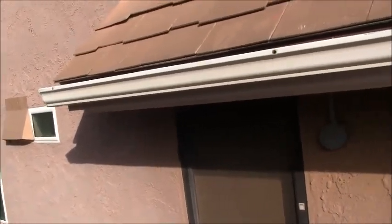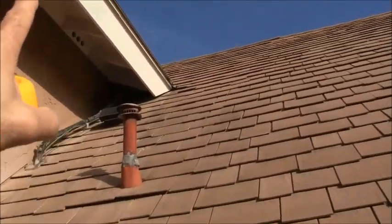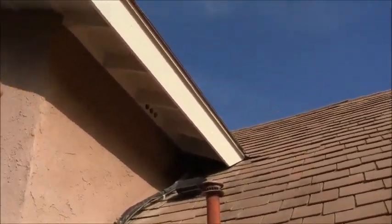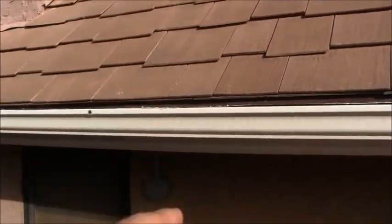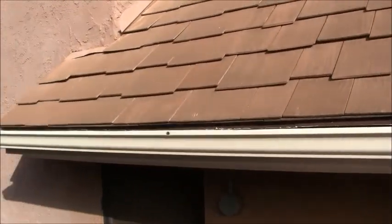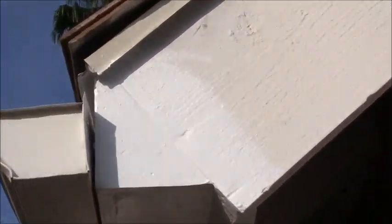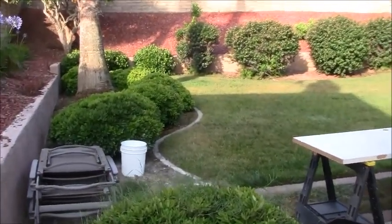On my particular roof there's an upper section — when it rains, water comes down to this section. So right here it catches not only this roof section but also the upper roof section. That drains down, comes over to the drain pipe, and out. This area was really critical to capture. This is what a properly installed gutter system looks like, and it's what the other side will look like when I'm done. The magic is building out that flat surface so the gutter tube has a proper place to attach.